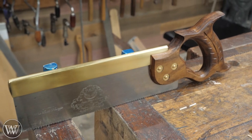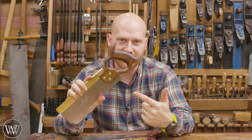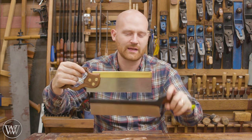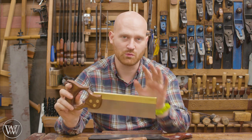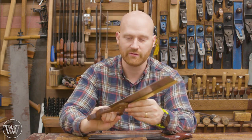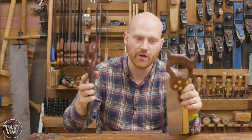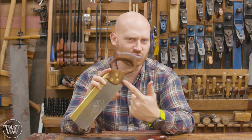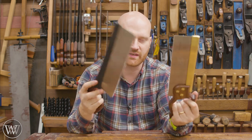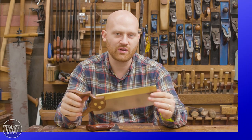I'm really happy with how this came out. It went from a saw that was uncomfortable to one that is perfectly fit for my hand and one I'm looking forward to using for a long time. The handle has been completely shaped and is now very comfortable. I would like it to be a little bit longer — that's one thing I don't quite like about PAX saws, they tend to be a bit stumpy. But for the money this is phenomenal. If you want a good brass back saw, the PAX saws are really the ticket. Shape the handle to fit your hand and you will have a saw that will last you a lifetime. This one is a little bit faster with a thinner plate, but this one has more weight — so when I want to be a little more lazy and not put as much force in, the weight of this saw will do all the cutting for me.